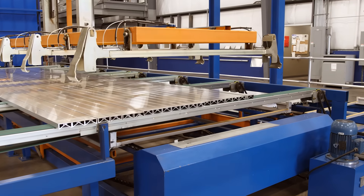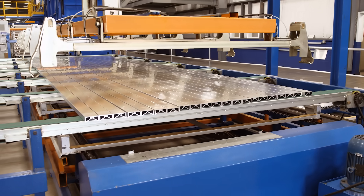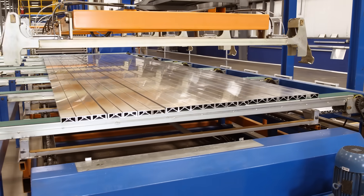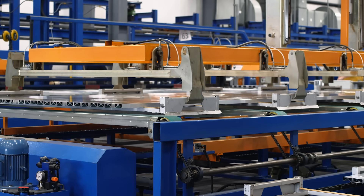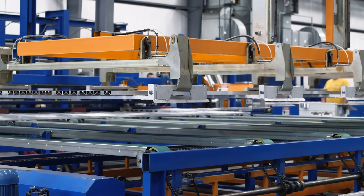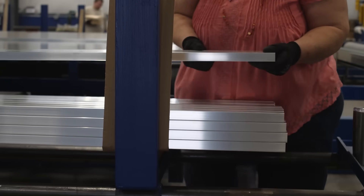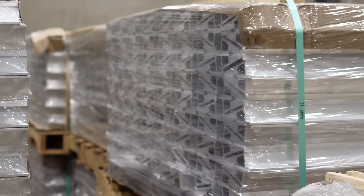This part will become the tray of a heavy-duty rack. After the profiles are extruded, they head over to the oven to be baked at 985 degrees. They are then aged at 350 degrees for an additional 8 hours. The extrusions are then packaged, loaded onto a truck, and sent to the 1UP facility in Wisconsin.